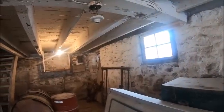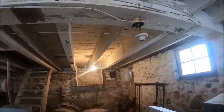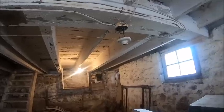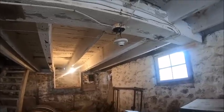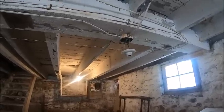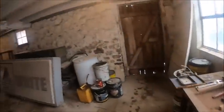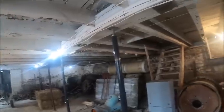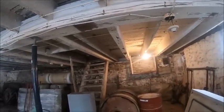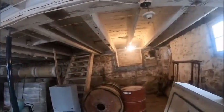Basically what I think I'm gonna do, because everything in this right now is just wired, is two wire cloth braid, I guess it'd be considered 2-12, which actually, I don't know if you can still buy two wire Romex or not, I've never paid attention. But anyway, I got 12-3 that I bought when I did some light wiring upstairs several years ago. So what I want to do is get all the lights tied into one switch, because right now this side of the barn is on one switch and that side of the barn's on another switch, and it's stupid. You flip the switch, you turn all the lights on. I don't know why they did it that way.